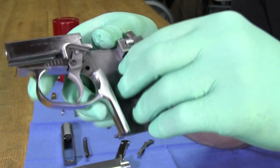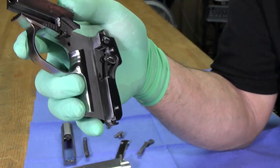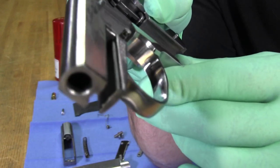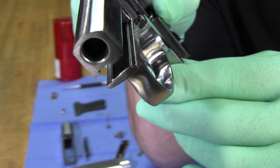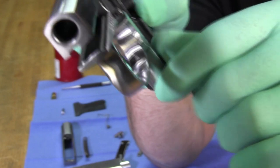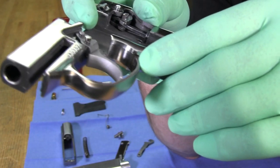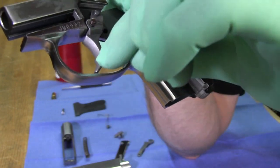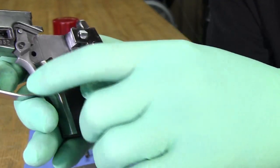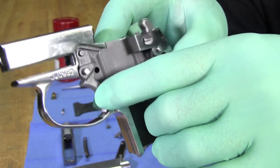What was happening is I kept looking at all the assembly parts up in here, focusing there because of the way the thing was binding as you saw in the previous video. But what really made me discover the cause — I'm hoping this shows up in the video — you can see the mark there in the trigger guard. See that scratch? The scratch is from the bottom of the trigger. What was happening is the trigger was too long as far as how far it extends down, and as I pulled the trigger back it was actually hitting the trigger guard before it was far enough forward for the drawbar to release the hammer.